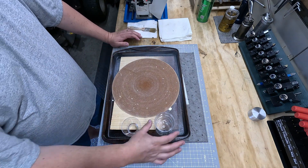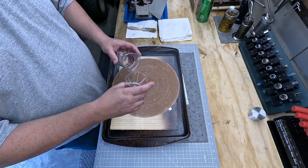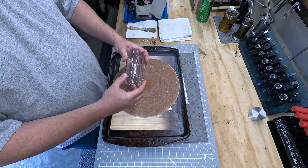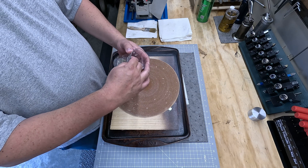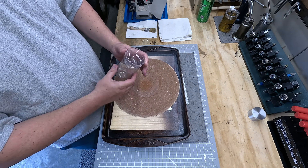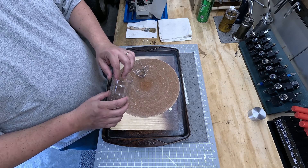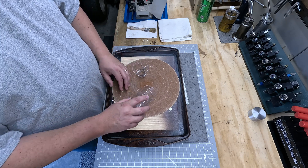We got this cut. It's not perfect — it really doesn't matter. All I want to do is have enough material to glue that on there, and then I'll come back and trim it up a little bit later. But I do want to sand some of these parts and I need to rough it up in order to let that epoxy adhere.